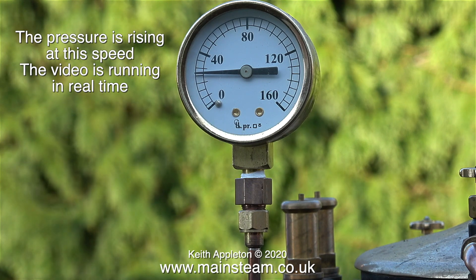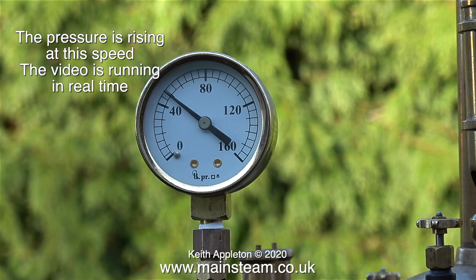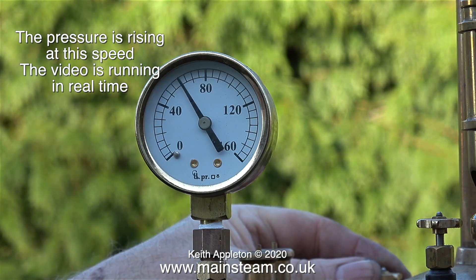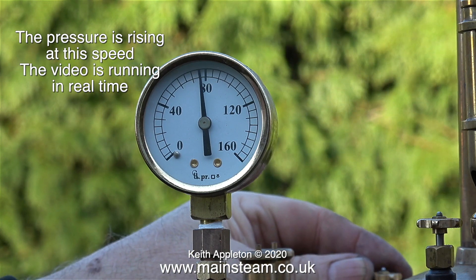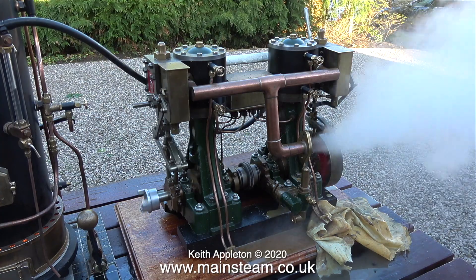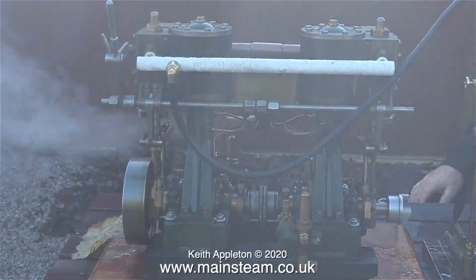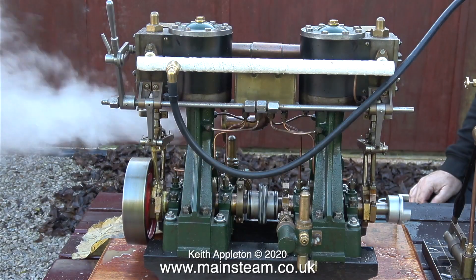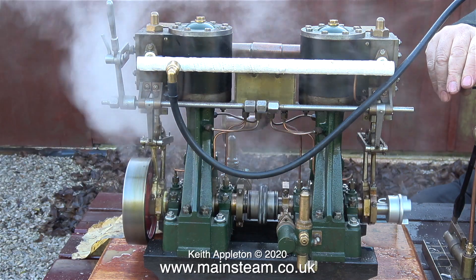Before going for the water I opened the fire hole door and closed the blower, but as soon as I got back with the water I closed the fire hole door and opened the blower, and in no time at all the pressure started to rise. Now the boiler's filled up and the fire is good — the pressure is rising, and the video is running in real time, it's not running fast. I have to say that this is not the normal thing you would get with a model boiler — these Castle V6 boilers are something special. With this amount of steam generation and the subsequent water evaporation rate, you can get into trouble very quickly. Look at the performance and speed of the engine with the steam valve fully open. But it doesn't last long — in no time at all the water level drops radically in the gauge glass and the pressure drops down to about 40 psi, although the engine seems to run quite nicely like this.